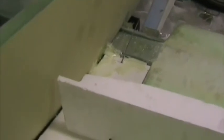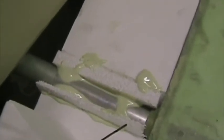Here's the start of the wing root fillet. We've taken the foam that was cut off when the wing was manufactured, and this is the piece that goes up to station one. That's where station one would have been. And just tacking it in place with blobs of micro and attaching it to the rear attached tube. Make sure that no micro goes onto the wing. This is to define this edge here, which must mate exactly with the wing root. Once this is set up, we can even remove the wing and start to fair in the wing root fillet.